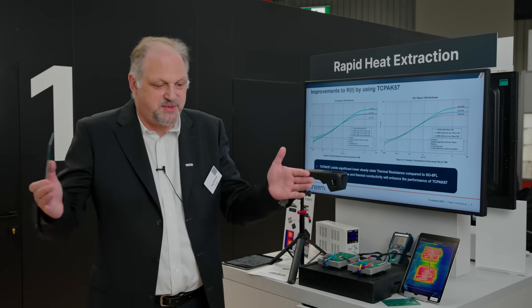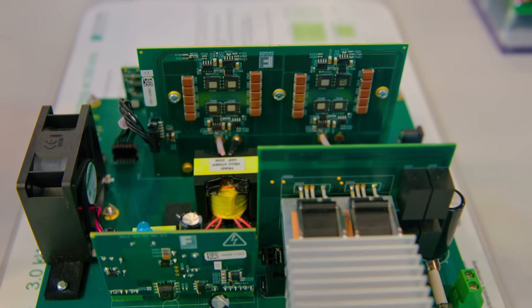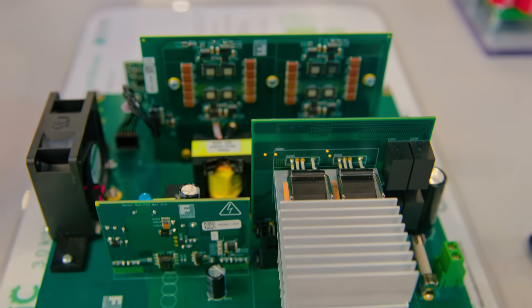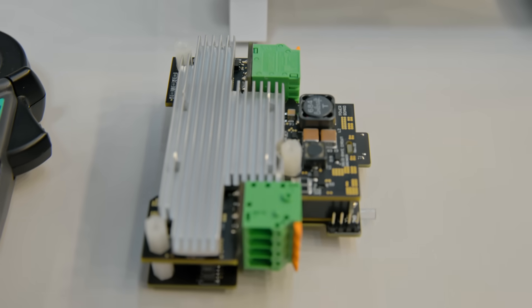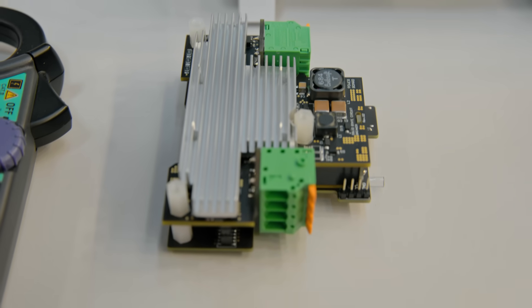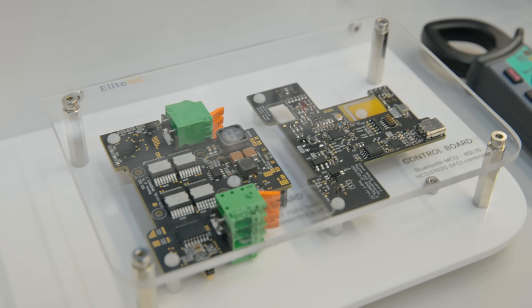Now you can make really neat and tidy things in the diameter of the motor. In the past, it was a big box on top of the motor. The traditional way of cooling is to put your aluminium plate below and sink the heat down. With top-cool, we're inverting that whole thing and pulling the heat from the top.